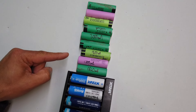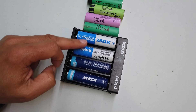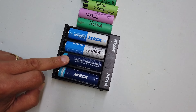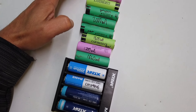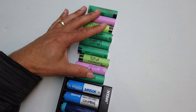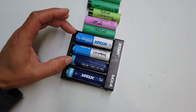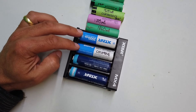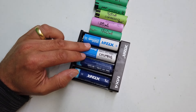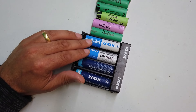So I've done quite a lot of testing with various different batteries — Panasonics and Samsungs, the Panasonics from X-Star, and the Chinese lithium in these X-Star batteries. The X-Star batteries claim up to 800 recharge cycles, whereas the Panasonics are rated for 500 recharge cycles. The average across all units was probably about 2,000 milliamp hours each. None of them are getting close to 3,500 milliamp hours when discharged down to 3 volts. You could probably drop that to 2.8 volts, but that's borderline, so I'm happy to stay safe at 3 volts.